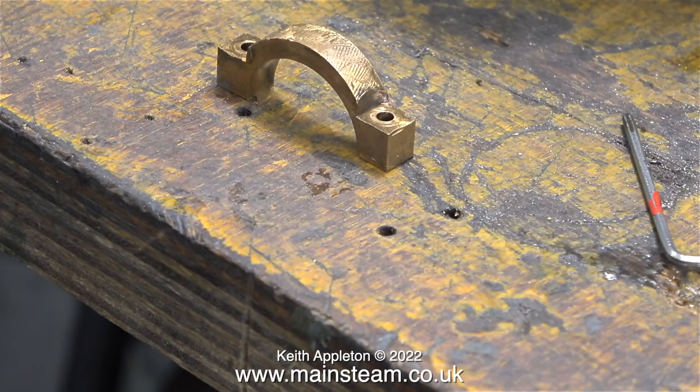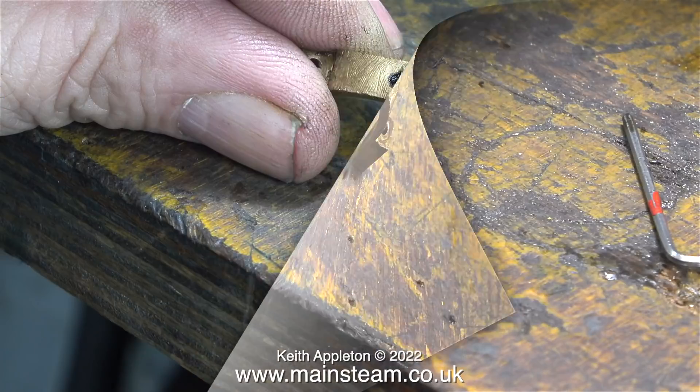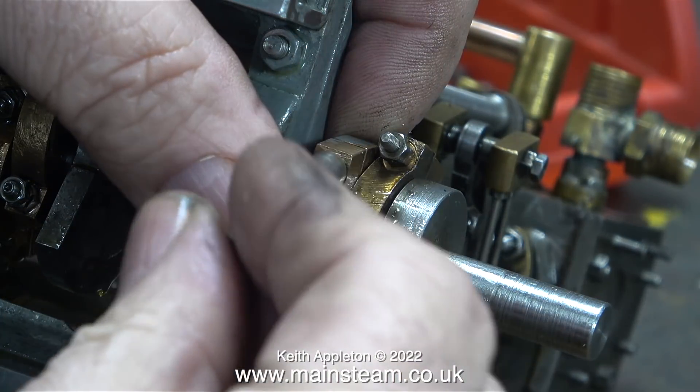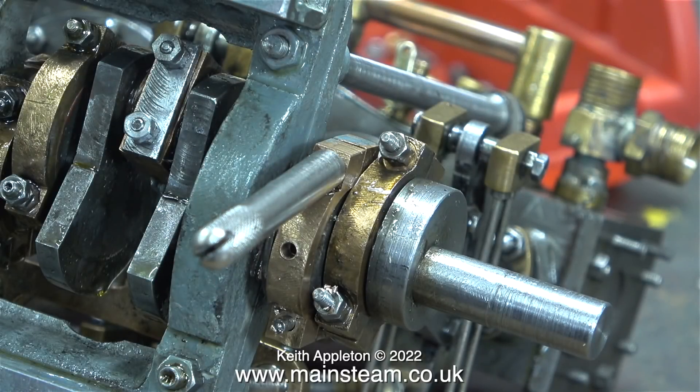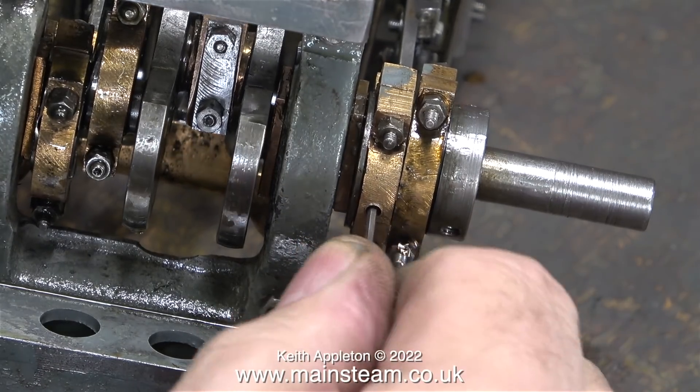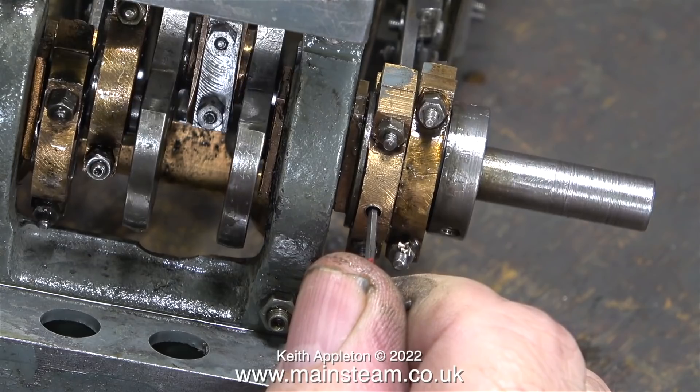This is the underside eccentric strap — once again it's not very well finished but I'm not concerned with that. I've marked a black spot on it using a felt tip pen and I'm going to drill a hole in the eccentric strap at this point. This is not good engineering practice but I do it a lot. If the black mark looks like it's in the right place, once I drill a hole on the mark, theoretically that should be in the right place — and as you can see it's quite close. The main thing is the hole in the eccentric strap perfectly matches the grub screw hole in the eccentric sheave, so I can put my allen key in there and adjust the eccentric sheave, then tighten the grub screw to hold it in place.